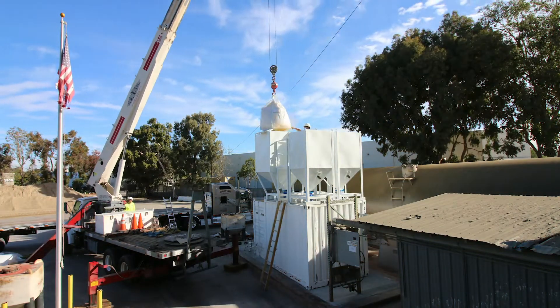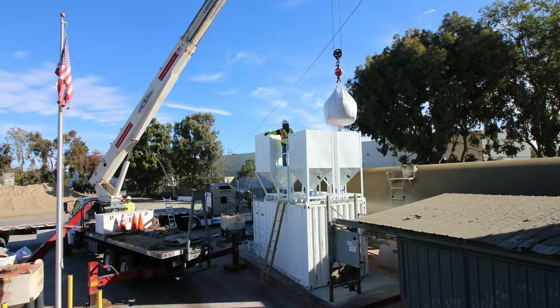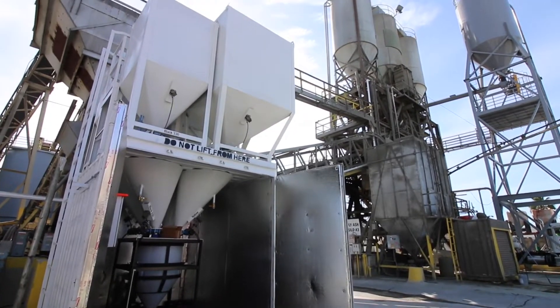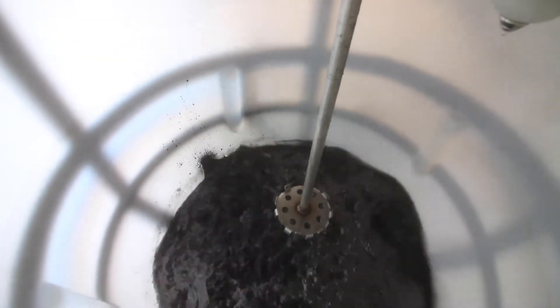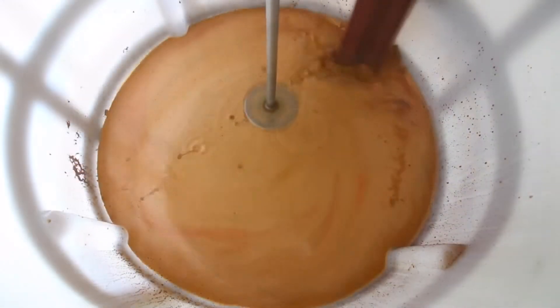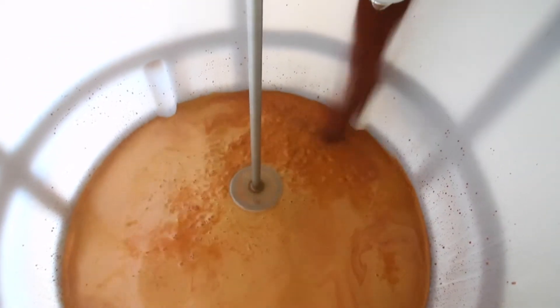It is contained inside an 8 foot by 10 foot container with roof bins on top to provide additional storage and feed the mixing vessel. All units are containerized, insulated, and heated to prevent freezing and condensation. In the center is a combination weigh vessel and slurry blender where pigment is released through four fill tubes into the vessel. The dry granules are sheared during the weighing process before being introduced into the mixer to achieve 100% tint strength to the powder.